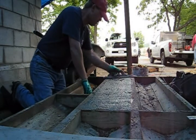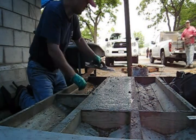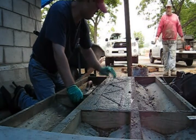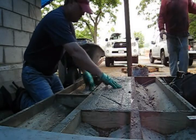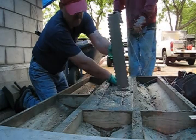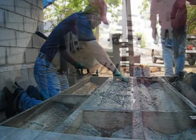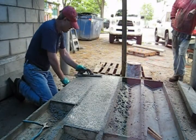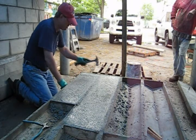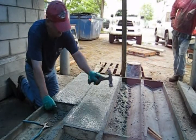The stones are poured upside down with the point at the bottom. Galvanized wire reinforcing is placed into the mix, making sure to maintain adequate clearance from all sides. This greatly strengthens the final product.